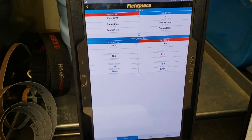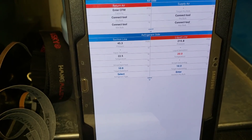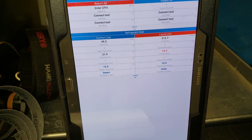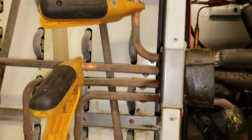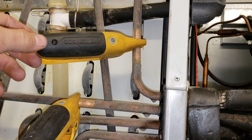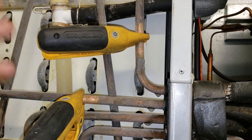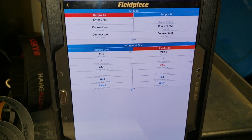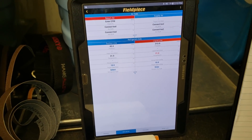Here's a little trick I like to show people if you're having a hard time with an expansion valve — do a temperature comparison. Look at my two temperature clamps. You want to put them approximately in the same place. Both those TXVs have the same load under them, essentially, so your temperature should be within a degree or so of each other. It's pretty good; I don't see a problem with that. I'm just confirming the TXVs are working properly.